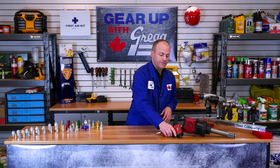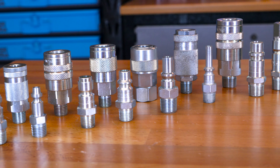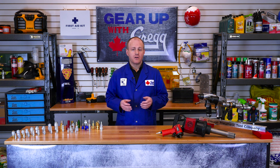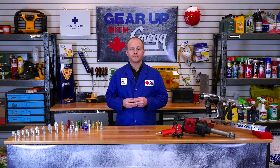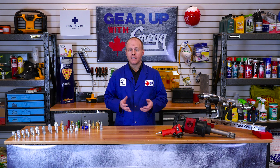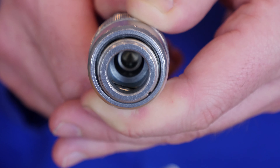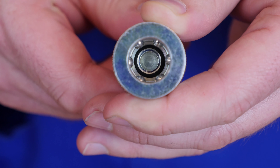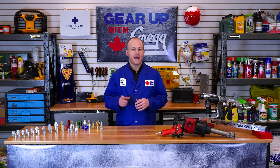Here at Greggs, we carry a wide variety of the most popular types of quick couplers which come in many different shapes and styles. Though there are a lot of variety between the styles, the basic functionality of all couplers remains the same. When connected, the plug end is held in place mechanically by the female socket. A seal is created and the air resumes its flow. The mechanical connection between the socket and the plug can be accomplished through a variety of materials and designs, ranging from metal bars to plastic or even ball bearings like this one right here. Though they differ, if used properly, they all provide a leak-free air flow and help you get the job done.